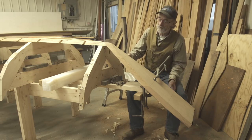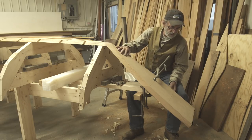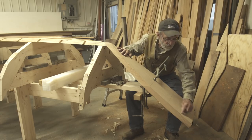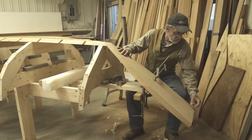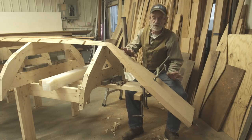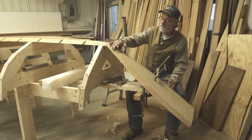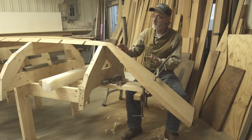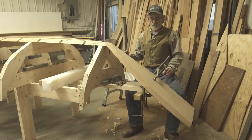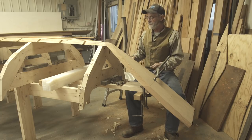It might take a little tiny bit of a micro adjustment up in here where I'm starting to bevel, and I haven't shaped it exactly the way it's going to be at the top yet. I'm going to shape it in a little more at the top, change the whole shape of the top, and of course it's a little tall — we're going to cut it round on the top. But the only place that's really important at this point is right down in here where the garboard planks are going to contact it. We've put it up there just like we did the stem because we have to have it in place in order to do any planking. There's an order to it and we're going to do it in order just the way it has to be done.